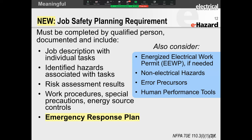What is the hazard? Once you've got the hazard, you're going to go through that risk assessment process, like, okay, shock hazard here at this distance. Okay, when I get in here, I need to be insulated. I need to use rubber gloves. I need to have EH rated footwear. I've got to probably stand on an insulating mat. If you all work at high voltage, you're power utilities, you're probably talking about equipotential zone creation. You're talking about grounding. And then the last bit is, is there an existing procedure that tells me how to change the fuse on this bus plug?